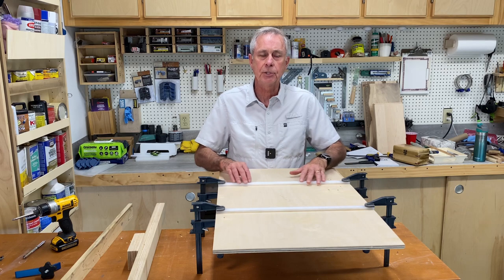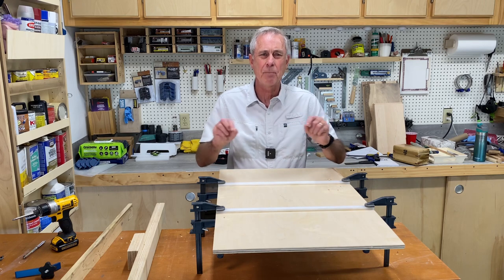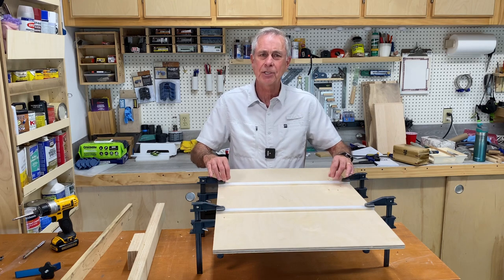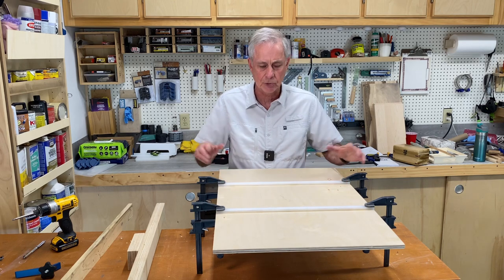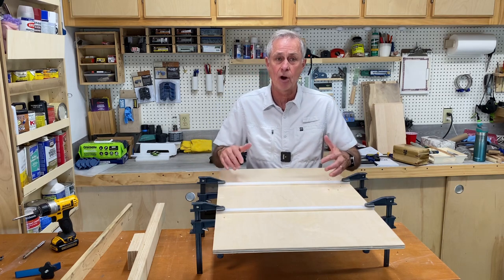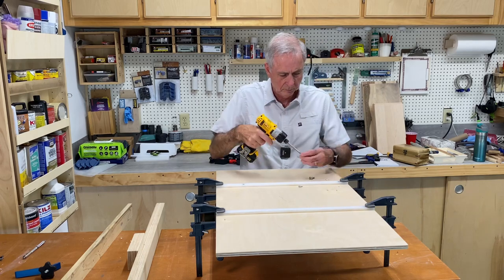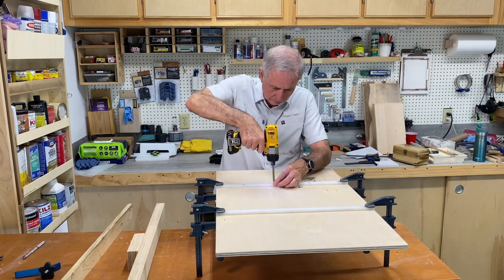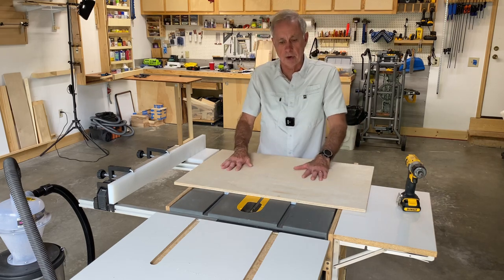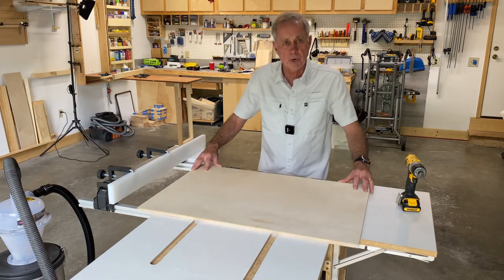When you do that step to temporarily mount the runners to your sled, if you have some double-sided thin paper-type tape, that may actually work better than CA glue. The CA glue does not like to stick to this polypropylene, so as soon as I got it on I clamped it to make sure it wouldn't pop off if jarred suddenly. Then I put the screws in. Once you've got your runners attached, before you go any further, get your sled back on your table saw and make sure it runs back and forth smoothly. If you need to make adjustments, this is the time.